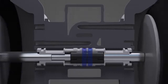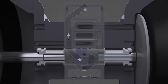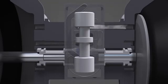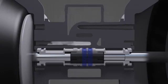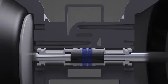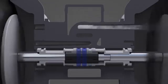When the pilot air valve travels far enough to the left, chamber 3 connects to chamber 2 and the air moves the main air valve downward. This causes the right diaphragm to pressurize and the pilot valve to begin moving right. Throughout the cycle, one side pressurizes as the other exhausts. This process constantly alternates between the pilot and main air valve to create a continuous cycle.